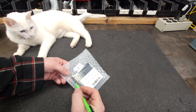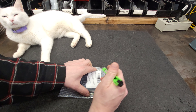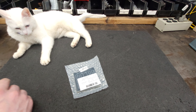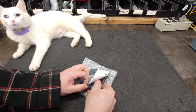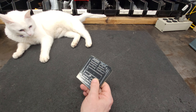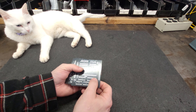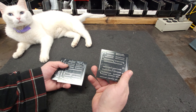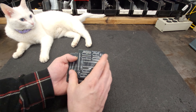I believe the CPU is dead in a Burger Time arcade that I picked up that was a basket case. I'm not going to probably be doing a video on that one — maybe I will later. I found somebody already made a Burger Time board but I improved on theirs. I added some surface mount parts to make it easier for assembly — the resistors and capacitors can go all surface mount. I also added flood fill and other items to the board.